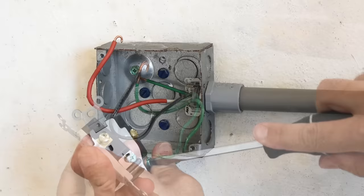If you have a 240 volt circuit that you want to convert to 120, identify the neutral wire by disconnecting it from the breaker, turning the power on, and finding which wire has no power. Take that wire, make it white with heat shrink or white tape, and connect it to the neutral bar. Then remove the double-pole breaker, install a single-pole breaker, connect it to the black wire, turn it on and you'll have 120 volts where you had 240. Any empty space in your panel can be covered with a plastic knockout cover. Thanks for watching.